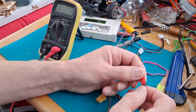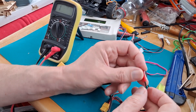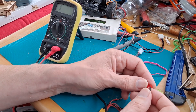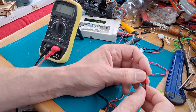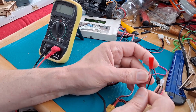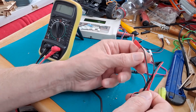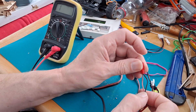Now, I am careful. I don't pull the wires rather than the connector. But this is a good few years old, so I suppose it's just general wear and tear and it has eventually migrated — the wires have migrated off the contacts. That's a polite way of saying they've just broken. No big deal. We'll just replace that. I could disconnect it there and re-solder it with all the rest, but I think what I'll do is just cut it here somewhere and put another short connector on.